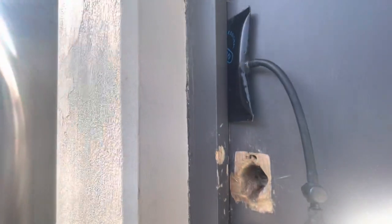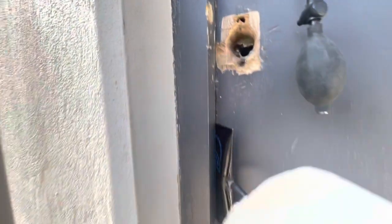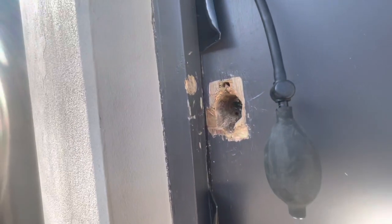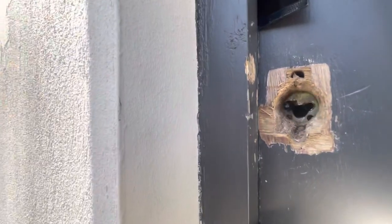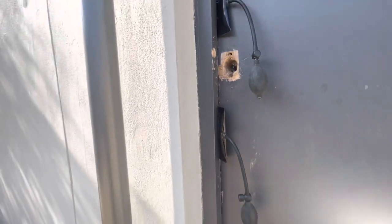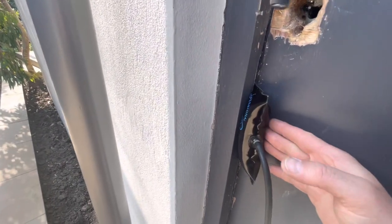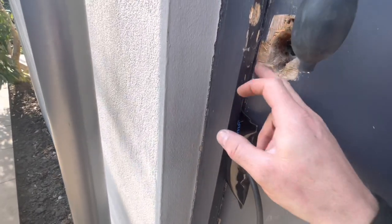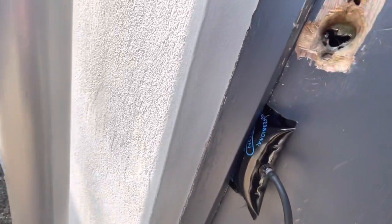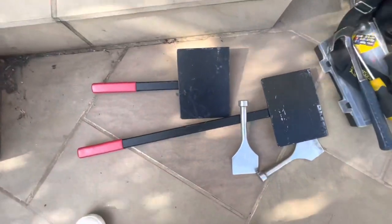There's just nothing at the back there. So I'm wondering if, where it's all been mangled up in there with the previous work, the anti-slip function might be disabled — I don't know. So I'm going to try that, and if not I'm going to try and air wedge it and ping it open that way. What I might do is try and prise the door away from the frame enough so that the anti-slip snib isn't catching and then try and slip it. But yeah, if not, I've brought the reinforcements out.